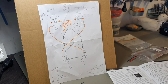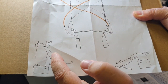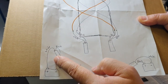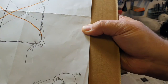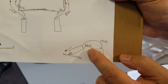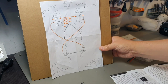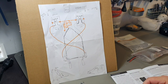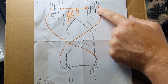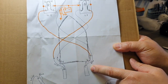So next, we also learned that when we want the actuator to be opened, meaning the tab will go down, we need to put plus to the white cable, and the opposite one. So when we want it folding, we want to put black on plus. I have shown you this in either this video or another one in the description below, how I test it. Let's combine this knowledge. So our right switch will be responsible for the left actuator, and our left switch for the right actuator.